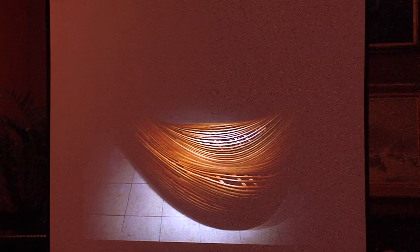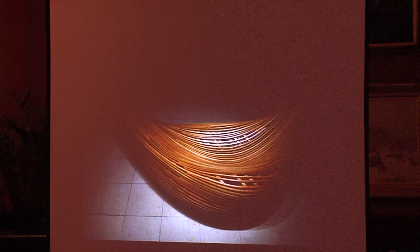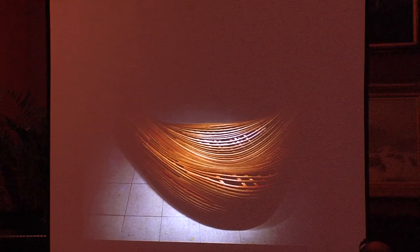So I basically reorient the structure of the wood inside. You know, because if you take even a strip of wood and you bend it when it's steaming, the outside of the wood, the fibers actually have to stretch apart. The inside of the bend has to contract, and then the middle of the wood stays totally neutral. So when you're steaming wood, you're really reorganizing the internal structure of the wood and the microscopic makeup of the fibers.